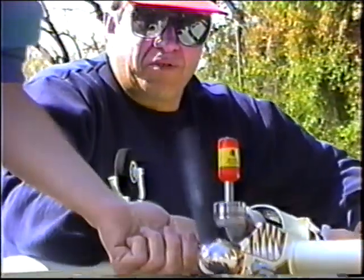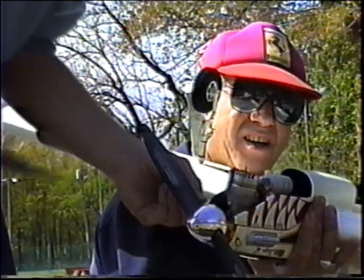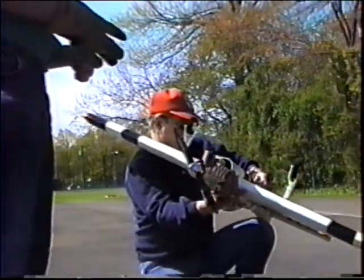Yeah, that thing's moving all over the place. You've got to tighten your gland nut. Yeah. Big time. Okay. Yeah, it's going south. I like to get that battery out of there. Even when it's inverted, it can roll under the prop. Let's try her again. You want to try it, flip it inverted? Oh, we'll try it like this. Yeah. If that's okay. No problem.